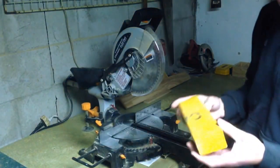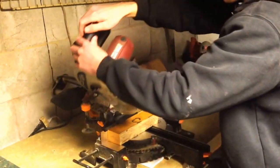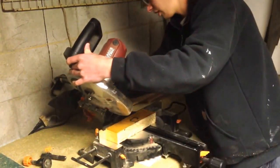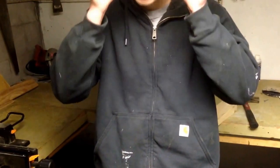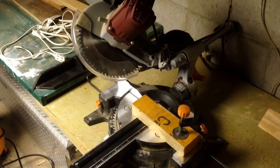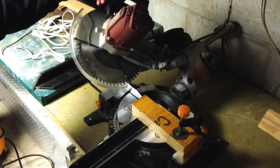To demonstrate what the LVL looks like and all the real layers, I'm going to cut it at a 45-degree angle so we can all get a closer look at what the LVL layers look like. I'm going to set this saw at a 45-degree angle and make the cut. It's always important at this step to make sure you've got your eyewear on — you don't want to get anything in your eyes — and put your hearing protection on. I've got the stock clamped down so I don't have to get my fingers in the way. Let's get started.